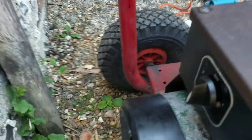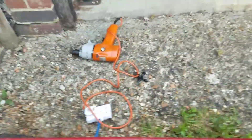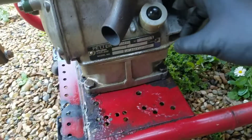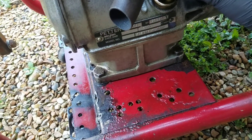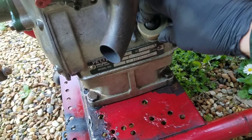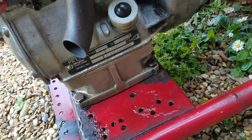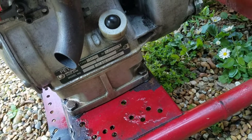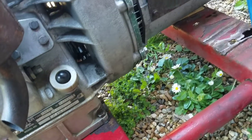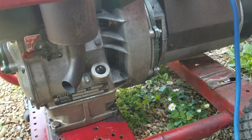On this side you've got a switch to select 110 or 240 volts, as we've done in this situation. Down here you've got an interesting little thing - it is the dipstick. There's also a little pipette, an oil dropper, so you can drop oil into the cylinder head, but it doesn't come open easily so I don't use it. You've got a data plate there - this machine puts out six horsepower at 3000 RPM, so it's a pretty decent machine to be honest. I don't know what the electrical output is because that data plate's gone, but it's been enough for what I need.